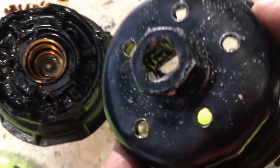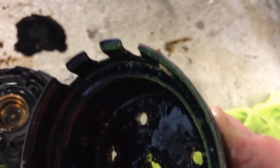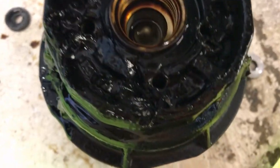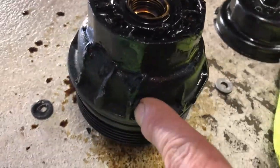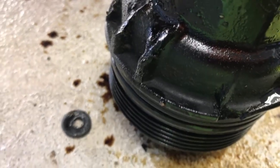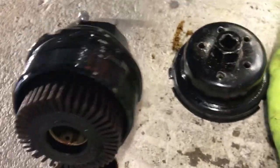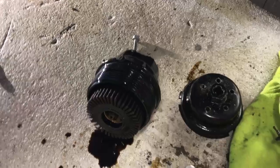To get it off, I drilled a couple of holes in the special wrench they have for this. Here are the teeth that broke off — and I was lucky enough to get this thing off of there by doing that. So if you run into this problem, just remember that little metal tab bends over and hits one of these little gussets, and you're not supposed to tighten this thing hardly at all. Hand tight is as tight as you're supposed to tighten this, because there is an o-ring. Anytime you have an o-ring you don't need any type of pressure.